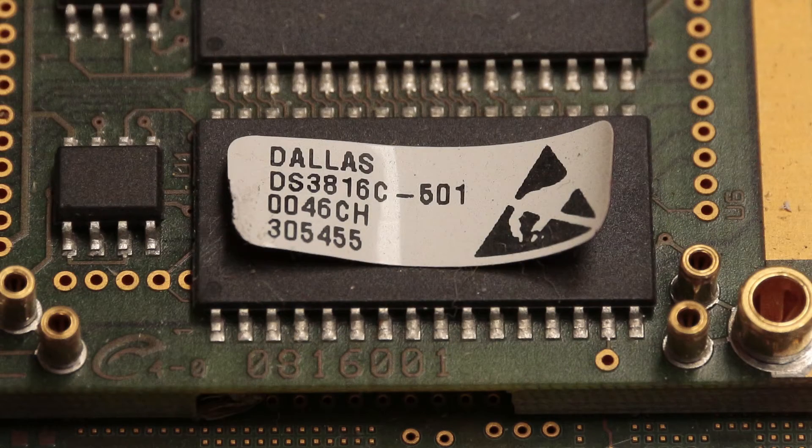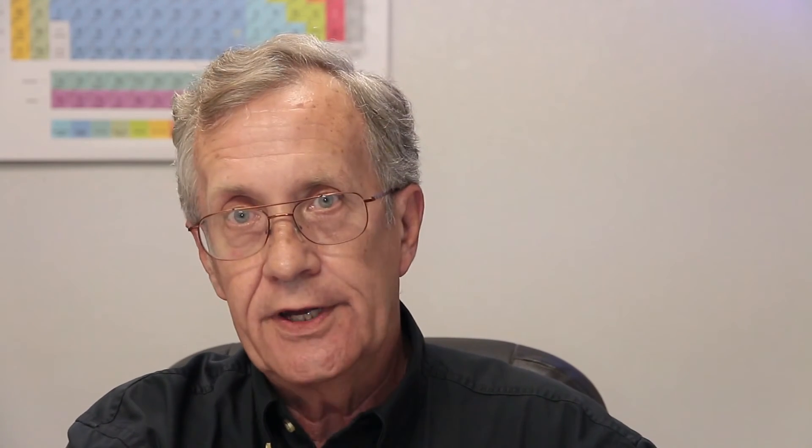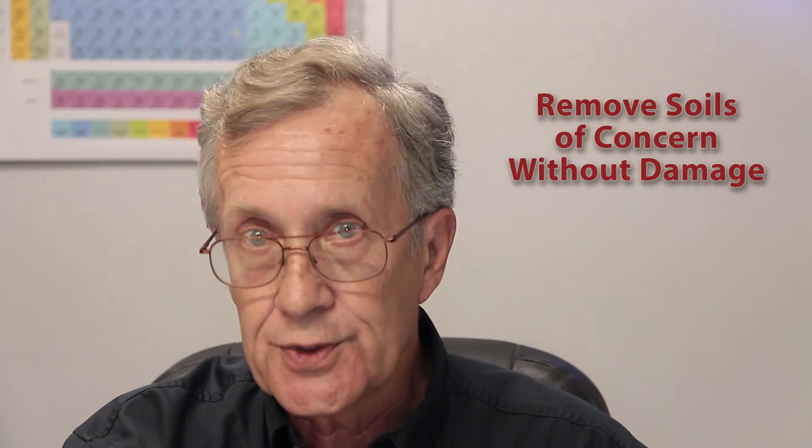This leaves us with the need for a new solvent tuned to the chemistry and physical properties of the residues we have on circuit boards today. If we're going to look for another solvent, we're going to look for one that will dissolve the residue we want to measure. A secondary consideration is that we want to pick a solvent that will not affect the other materials on the circuit board — we don't want labels coming off, organic materials melting, glass seals cracking, or corrosion occurring. We also want to select solvents with good safety parameters such as flammability, toxicity, stability, and reactivity.